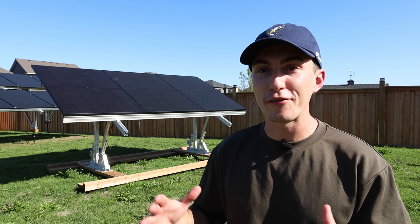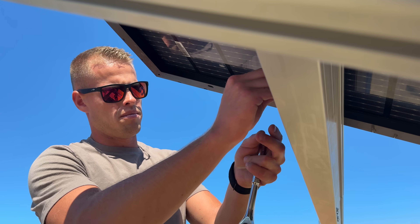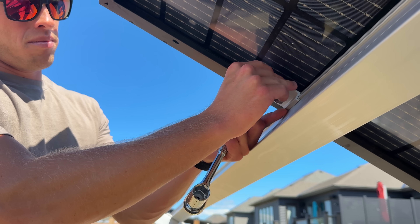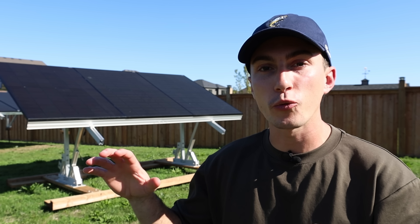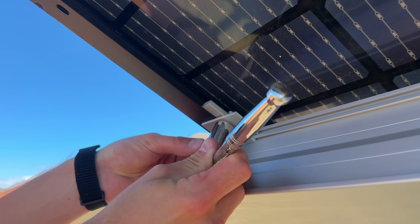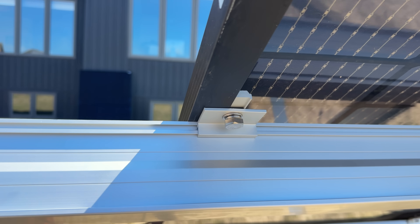It's actually probably the best footing we've seen on a full-size solar panel ground mount yet. Another thing that we absolutely love — and it's what makes this thing look so good sitting behind me — is it has reverse mounting hardware. Not a single piece of hardware goes on top of the panel to squish it to the rack. It all grabs it from behind. So when you look at it, there's no seams in between the panels, no hardware holding the panels on. It's just seamless panels sitting on top, which honestly makes it one of the cleanest looking things we have here at the lab.